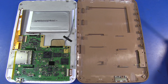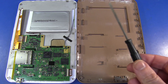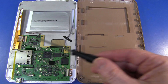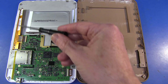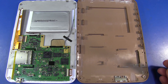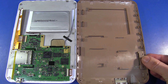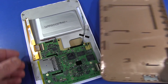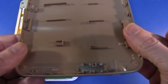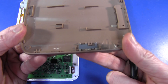Let's take a look inside. It's not nearly as interesting as the Kindle, but that's to be expected — it's a bit less feature-packed, but it's got all the basic stuff you would expect. There's the large lithium-ion battery, the PCB we'll look at in detail — it's a single-sided load which gets manufacturing cost down. There's the membrane going to the e-ink display and another membrane going to the keypad. The back panel has nothing happening, and there is no RFID tag built in. The main PCB is pretty much it, and there's a Wi-Fi antenna up there.